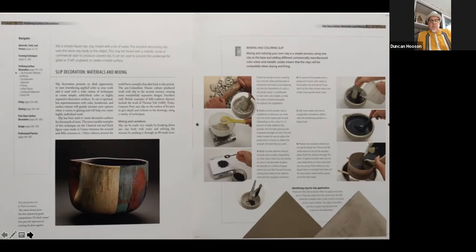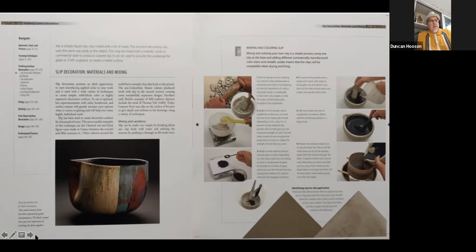This slide shows how to make your own slip and your own colored slip, always starting from dry materials. If you want to be able to repeat results — because we can be very experimental with surface treatment — if you record accurately you'll be able to repeat that surface or effect again. Take materials back to the raw state, add stains so you know what percentage by weight you need of that particular stain. All stains vary, but really understand that it is a recipe to be followed. The next slide deals with the consistency of slip.